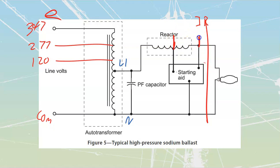When the arc current becomes too low, the voltage inside of here is going to be trying to interrupt and refire this thing repetitive times. You're going to get the cycling of your lamp, where the arc current gets too low and it extinguishes itself, and then this thing picks up because it doesn't see voltage anymore, and it's going to restrike it. We call this cycling. It's not a long restrike time, so oftentimes consumers will just leave it. They'll say, oh yeah, sometimes the yard light turns out for a minute, but then it comes back on, so that's fine. It's just not good for this over here. This is designed for infrequent utilization. You'll burn it out if you've got a cycling lamp. Just replace that lamp at that point. It should be good to go.